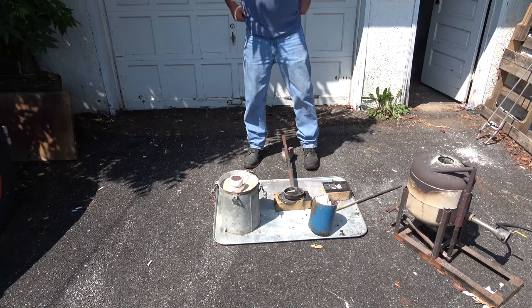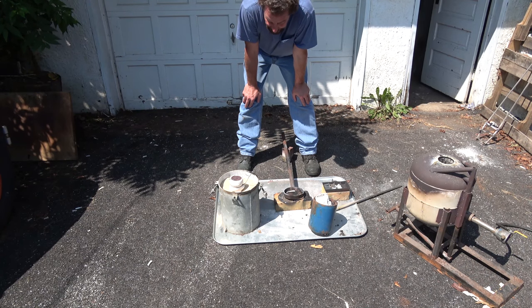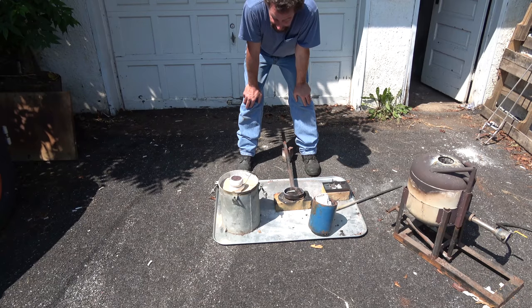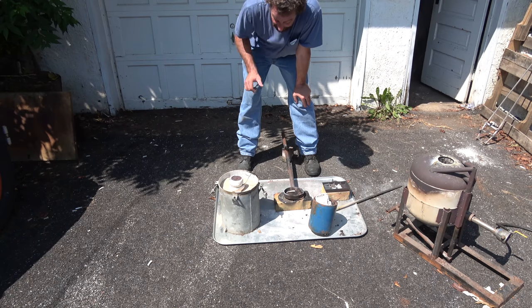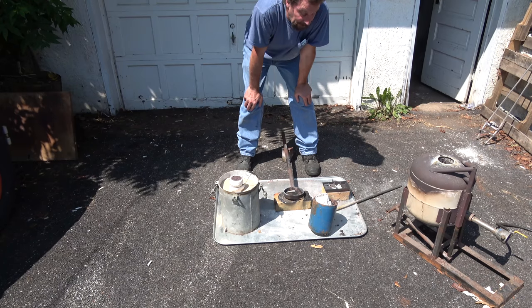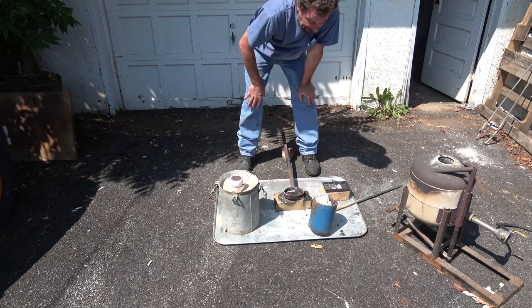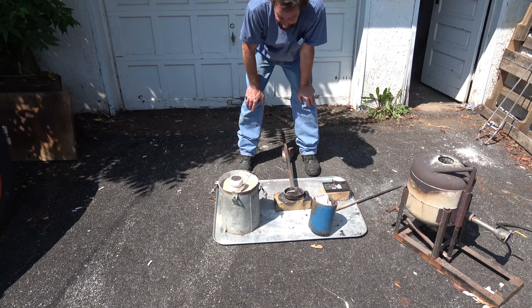I'll be honest, I don't like the way either one of those two pours looked. I'm trying out a new flux. Did you notice the pours look a little stringy? That's not really what I wanted to see. We'll keep our fingers crossed that everything came out okay. That one's probably about ready for breakout. We'll see.